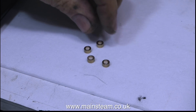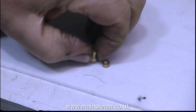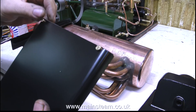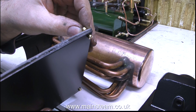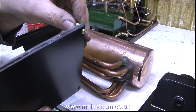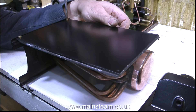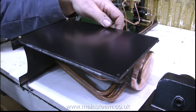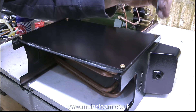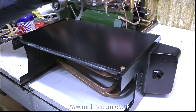Then I made eight of these — little brass bushes. These brass bushes fit onto the bolts, so that when I screw the side panels into the front and rear cast iron supports, the localised pressure of the bolts will not crush the insulation, and therefore will not bend the side panels. A simple solution that was very easy to achieve. And as you can see clearly from this clip, the side panels are no longer being bent as I tighten the bolts.